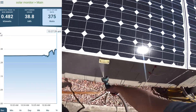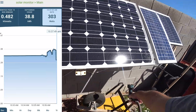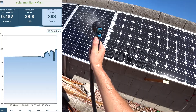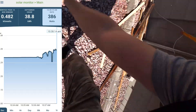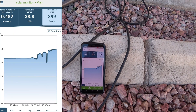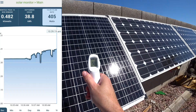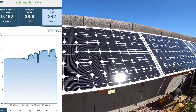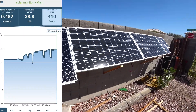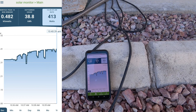You can feel the hot water dripping off them — it's hot on my hands, so warm because the panels are just so freaking hot. The heat is coming off slowly. As you can see on the side of the screen, it's already at 394 watts and going up more and more. Temperature readings are now showing 90, 92, 96 degrees — they're not even that much cooler yet. It's 120 degrees outside here in Vegas. At 82 degrees panel temp, they're already doing 413 watts.